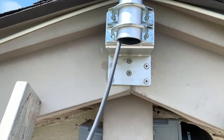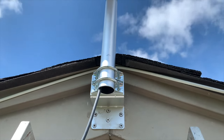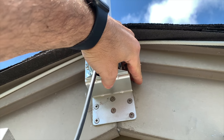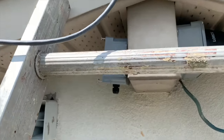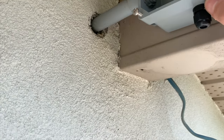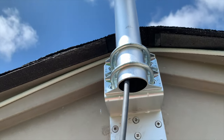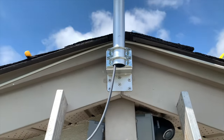So far we've mounted the Starlink dish. But as you can see, in the wind it wobbles quite a bit because this mount is kind of flimsy, so we're going to create a bracket here to hold it stiff — hopefully that will resolve those issues. We've also drilled into the wall, installed the conduit and the junction box with the wire grommet. We've got a grommet for this wall as well, and we're going to try to keep this tube sealed so no bees or bugs get in there.